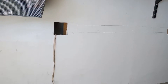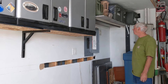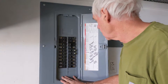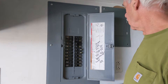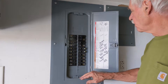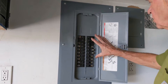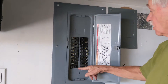We're going to use that to pull the cable to this outlet and make our connections inside of the panel. One thing to note: if you have a panel like this, some of these breaker slots are dummies — there's no bus behind them. But when you have a full panel with no room for breakers, you can use tandem breakers that have two breakers in the space of one.